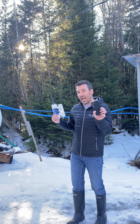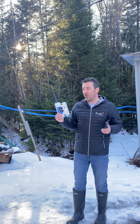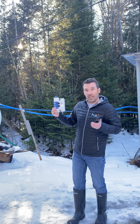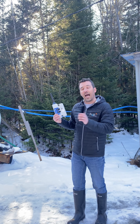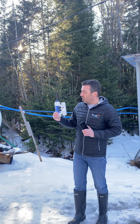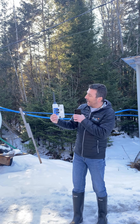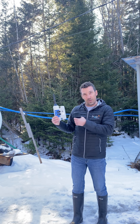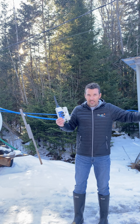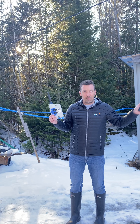You need to carry your tablet with you and scan each sensor on site to get the correct location in the tablet. Scan it — how to scan was explained in the gateway startup video. It's scanned in, it's here, and it's blinking fine. Now turn on a second sensor and wait until the lights blink synchronized — once that happens, they're communicating. Then keep going to the second destination, pay attention to the blinking lights, and so on until you're done with the installation.